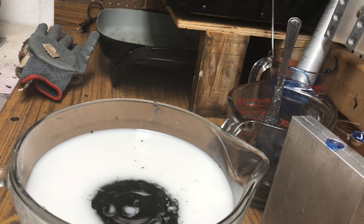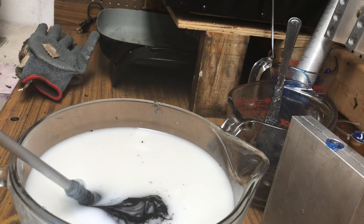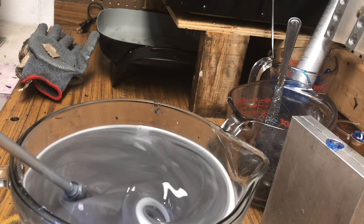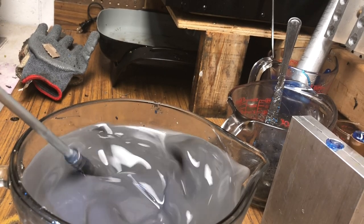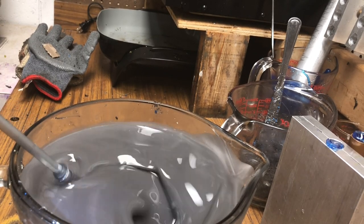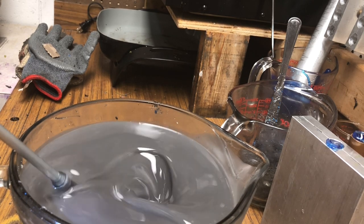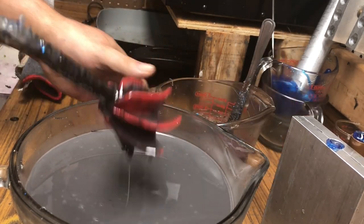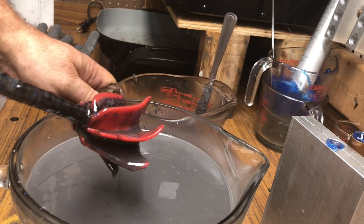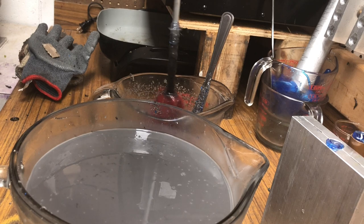From there, in this situation with 64 ounces, it's real easy to mix with a knife. But I've got a cordless drill with a plastic tip paint mixer on it, and I'll mix in the black, run it on medium or slow for a couple minutes just to make sure all the colorant gets mixed in. Then I use a smaller Pyrex to get all the drippings off by putting it down in there and hitting it real fast.